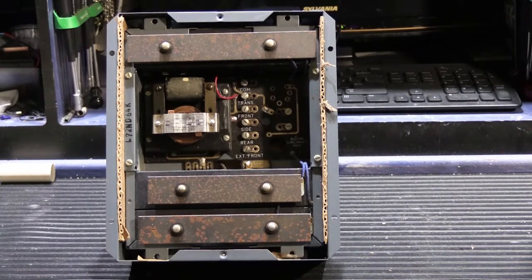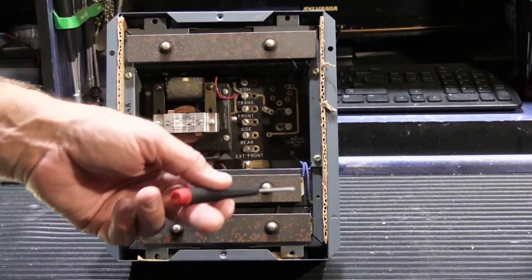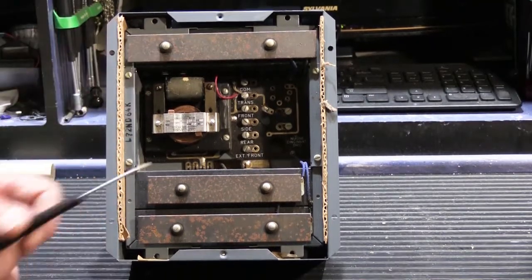That chime was a model L70. This fundamental design with the pickup coils and tone bars and so forth was in use all the way through the end of, say, 1983. And in 1984, we have the first intercom chime modules, which are an electronic board that reproduce the chime sounds of a chime like this.